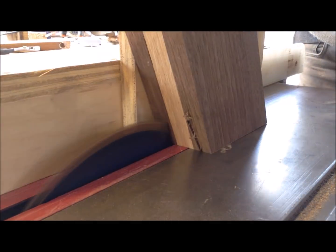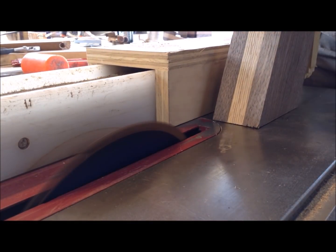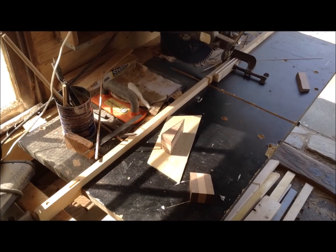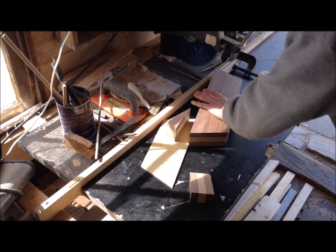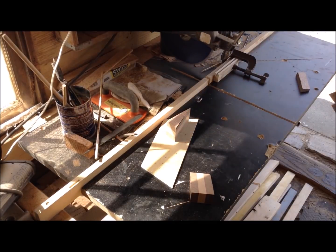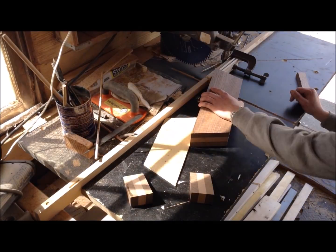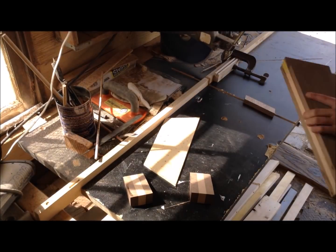So the end of that dovetail just hits the red oak, and I used a jig I have for cutting tenons that rides on my table saw fence, and I just sliced all of those dovetails. Now I didn't want to change the degree on my table saw for when I cut the other part of the dovetail, so I set up this little system on my radial arm saw in order to remove that waste shoulder. I raised the blade on my radial arm saw, and I actually used my template to set up and get that straight edge and cut that waste off.